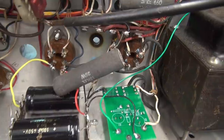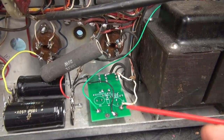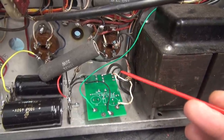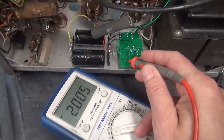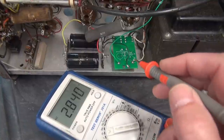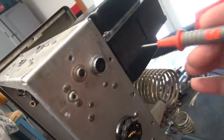I have disabled the high voltage because we know the 3B28s are not going to receive the proper voltage, so I have removed the plate cap wiring. We will just be keying the push-to-talk module and you will see the new voltage on pin 2 of the mic jack, which should be somewhere between 14 and 16 volts. The Valiant is plugged in, filament switch is on, high voltage switch is off. Let's verify that we have 6 volts going to the K1 module - and we do.